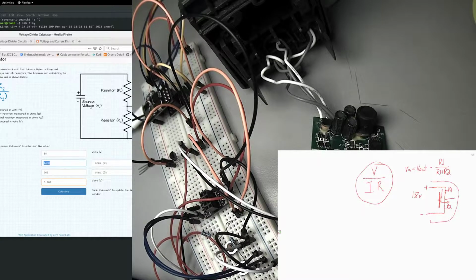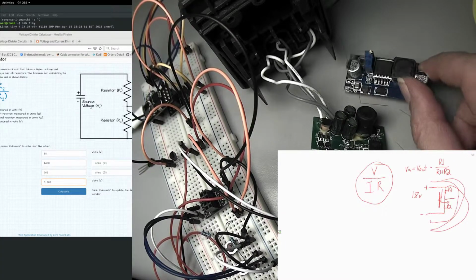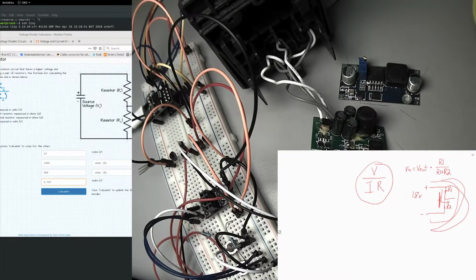So, I guess my question is, this all just seems really, really wasteful, and I know the whole project is wasteful, but what do you typically do in this scenario? And am I thinking about this right? I've never used voltage dividers to actually supply power for something, but my 3.3 volt regulator can't use 18 volts. So I guess the only other alternative I have is to drop in a switch regulator, which seems like it'll be just as wasteful. And then what else did I think? I was actually wondering if an op amp could be used, and if that might be more efficient.